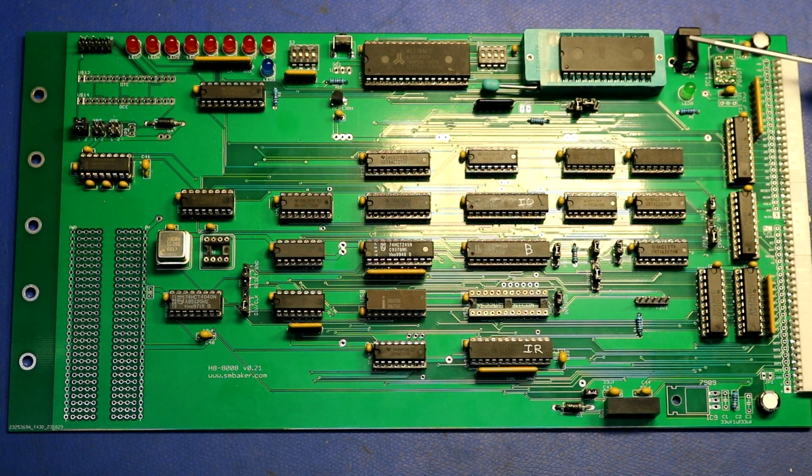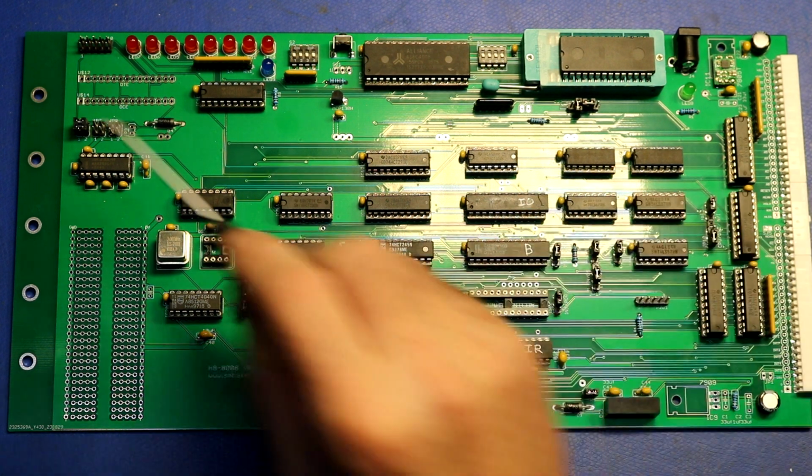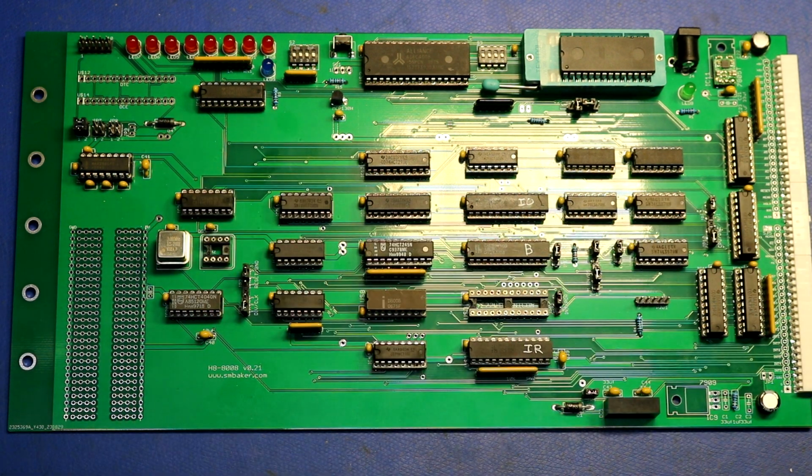And that way you can hook it up to this jack here, and you can actually run this thing as a single board computer from a single 5 volt supply out the BitBang serial port, without hooking the rest of an H8 up to it at all. And that was helpful in the initial trying it out and such, just to be able to plug it in as a single board computer.